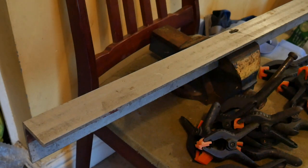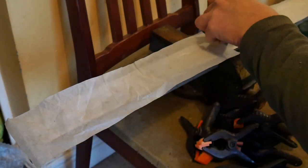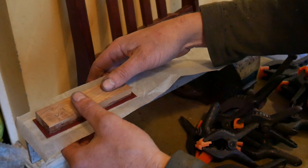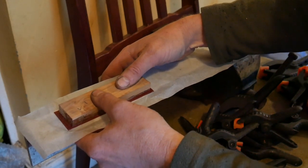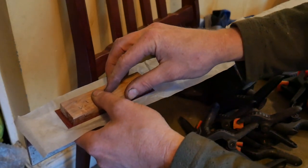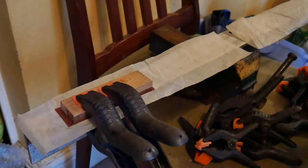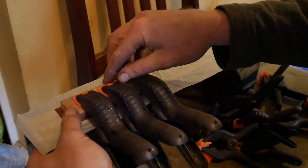Lastly, the clamping up. I've got a little clamping device — it's a piece of flat angle aluminium. I place a couple of pieces of greaseproof paper on it — this stops the epoxy from sticking. Then it's just a matter of placing the scale and the liner together, giving it a bit of sideways pressure to distribute that epoxy equally, then clamp it up and leave it overnight. Tomorrow these will be ready to fit to the knife. Make sure they're lined up nicely.